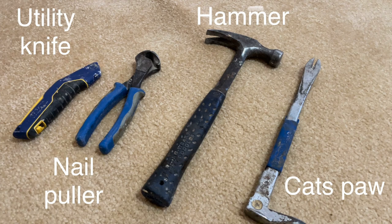Once you've removed all of those staples, then there's a tack strip along the perimeter. Depending upon how they installed it will make a difference as to how much work it is — some just use the nails that are in it, some add extra nails. Generally the best way I've found to remove it is get a flat bar or a cat's paw type thing, get underneath the nail, and then just slowly pry along. I'll show you my favorite tools for removing it.